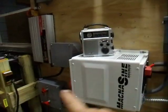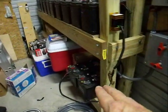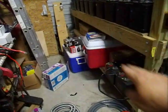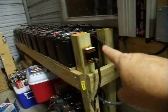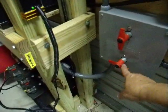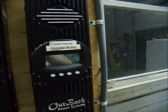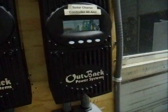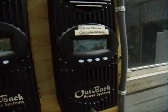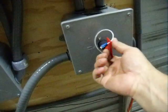I've still got to mount the remote control unit and the battery monitors out there. The GC2 batteries — the 6-volt battery bank — is going to go down here. That's a 12-volt battery bank, and that feeds a separate circuit altogether, which is in use right now. And you can see I can isolate the batteries here and shut off all the power. Those batteries are getting charged from this charge controller, which is coming in from my Harbor Freight panels, which I'm going to expand. I've got 420 watts and I'm going to expand it up to 800 watts, bring it to its full maximum, and then I can disconnect it here.